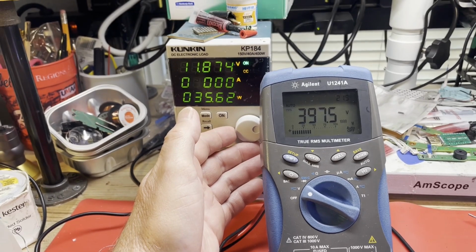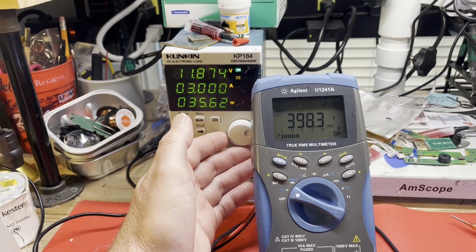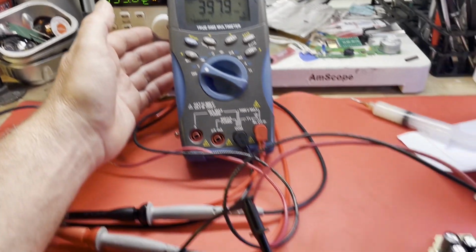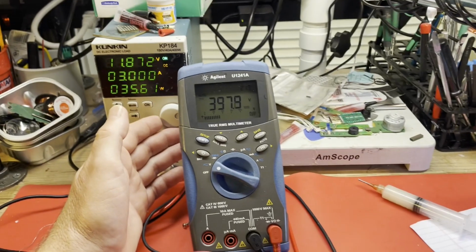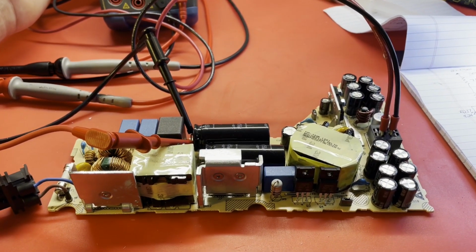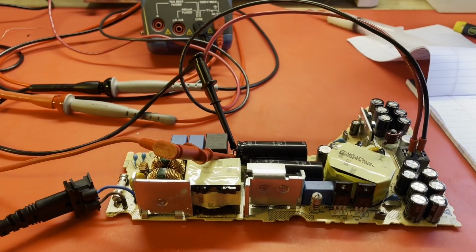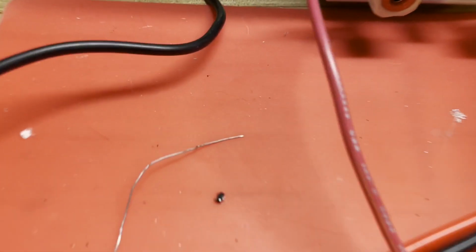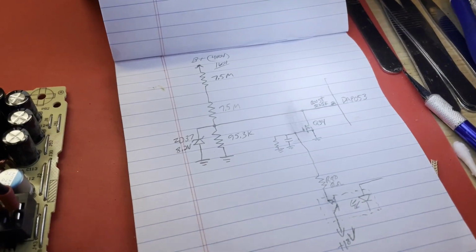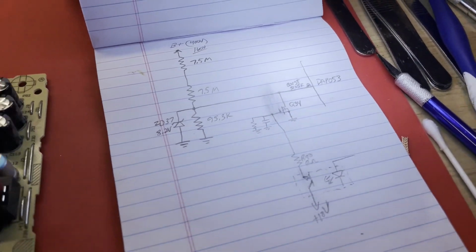And I think I'm going to go ahead and change out that ADP-400FR as my next stop. Okay, there's not a whole lot to this circuit as far as feedback and generating that boost voltage. Not a whole lot to it. So, all right, that's my next stop then. I'm going to go ahead and change out the ADP-400FR. And then I'll also probably put that little MOSFET back in that I pulled out, this one, Q34. I'll put that back in there.